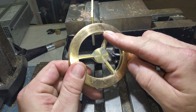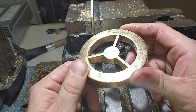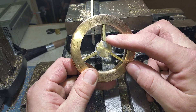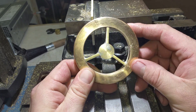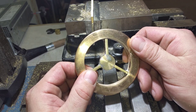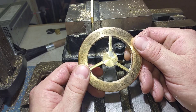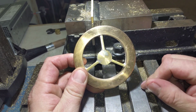I just took these solid pieces and soldered them into this ring — made it real smooth. What's happening is every time we try to pull it out of the sand, the sand sticks in three areas. I've been working on this a week and I cannot get the pattern to work. So we're going to try making a two-piece pattern — the hub as one piece and the outside ring as another piece — so we can take it out of the mold in two pieces.